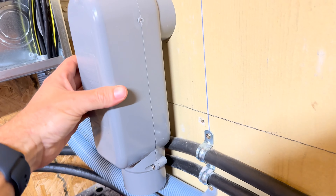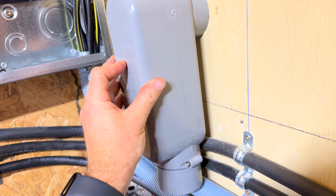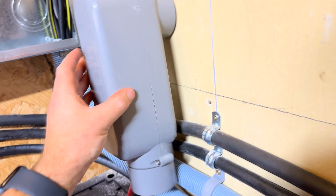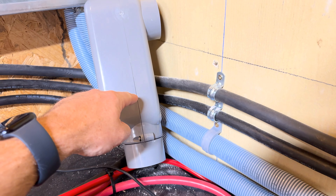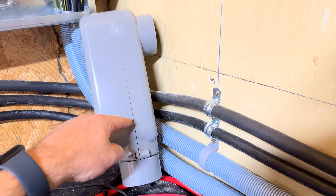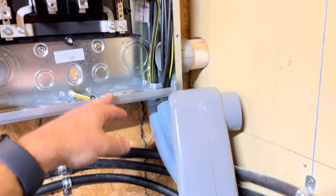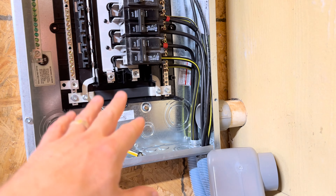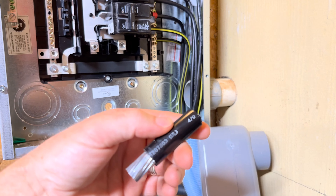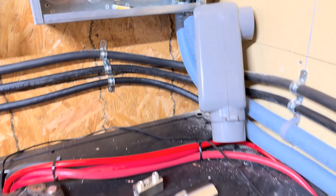It's going to be coming through on this other side, and I think right here in this box is where I'm going to make my splice. I'll come up out of my Schedule 80 two-inch pipe into this box, and then I'll splice in and come through here. That'll also just allow me to manage navigating inside this box a little easier, because this four-aught is crazy hard to deal with. So that is the goal for that.